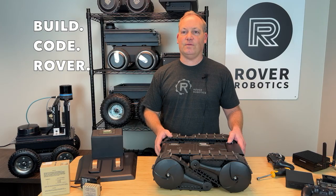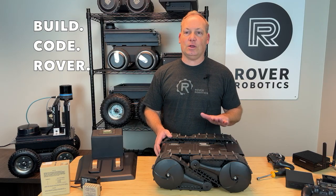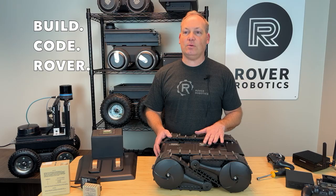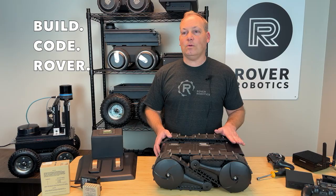You will receive your Flipper Rover Pro assembled compact like this for shipping purposes. You can adjust the flippers in the front and back by removing the wheel nuts with the 8mm hex screwdriver. Align the rear flippers level with the bottom of the chassis, and the front flippers can be rotated manually with the power off, or with the PS4 controller when a computer is attached.